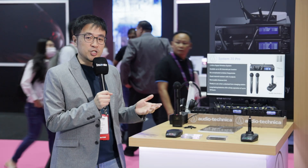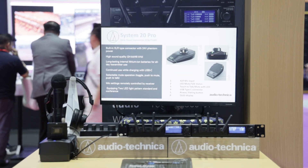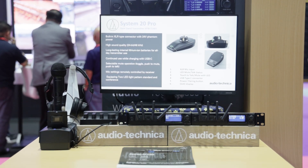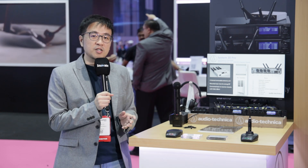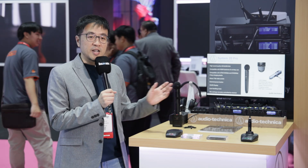This wireless receiver is a four-channel quad-channel system in a half RU size. You can pair four microphones to one half RU receiver with four outputs going out. This is the first in the industry to send four channels over 2.4 GHz to a receiver. In standard mode you can do 10 channels, just like our first generation System 10.